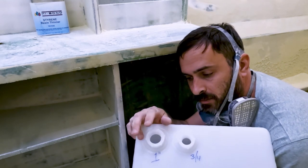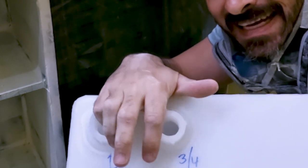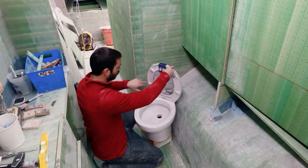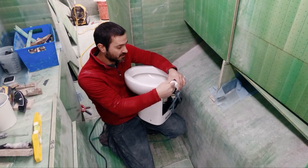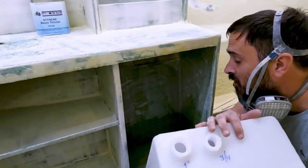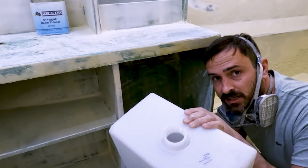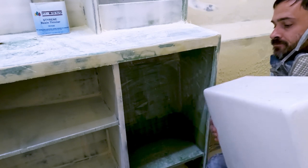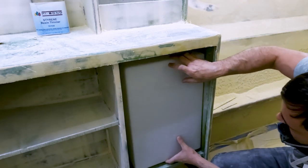Now, we ended up having just two fittings put on the top here, one the vent and one the intake. And to remind people, these are electric heads, so they cut up everything as they're discharging. The macerator is built into them when it pumps it over, so it's all liquids coming across. And then on the bottom, so we can do a gravity dump, this is a 1.5 inch fitting. And this just goes right in here.